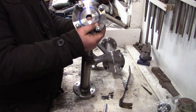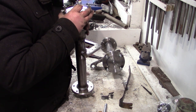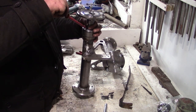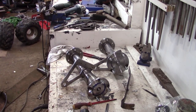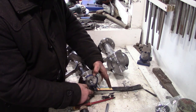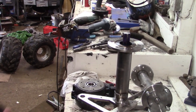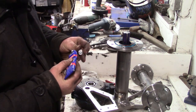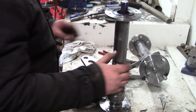Putting a key in and then smashing the hub on the outside of it all. That key was trying to wander out the bottom - that's why I've got a screw in there, just to make sure it stays in the right place. Now those nuts are going on the hubs. I need a little recess in here for the washer and nut to sit in halfway so they're not sticking out too far from the end of the hub. Now I'm just getting a bit of blue RTV silicone on the O-ring - just to hold the O-ring in place while I flip the whole lot over and stick it into the diff.